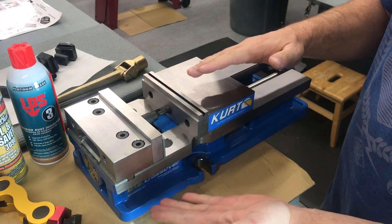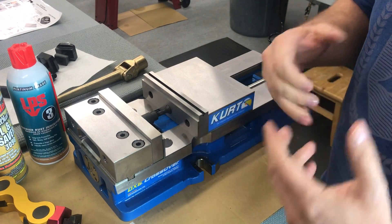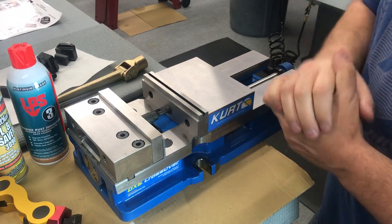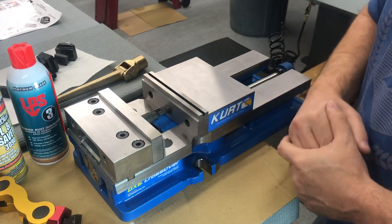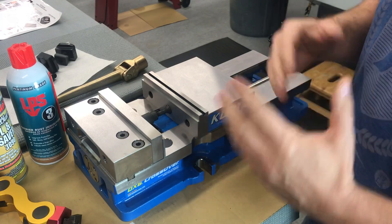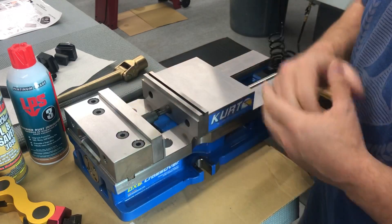You put it onto the bottom of a surface like the vise. The pallet system doesn't need it because it's already anodized aluminum and it's not electrically conductive, but you put that on and then you install everything. Six months from now, if you have to break your setup down, you don't have to worry about rust, staining, and corrosion going on in between your vise and your table.